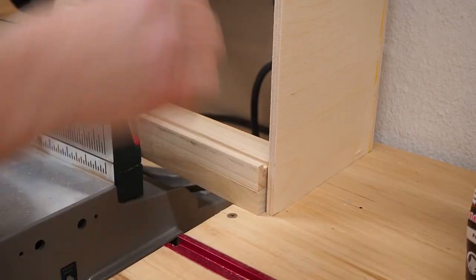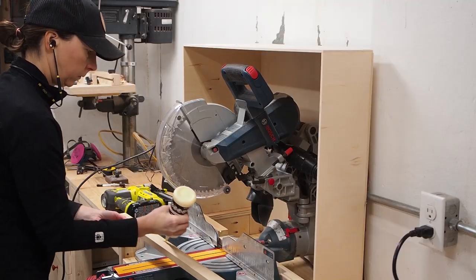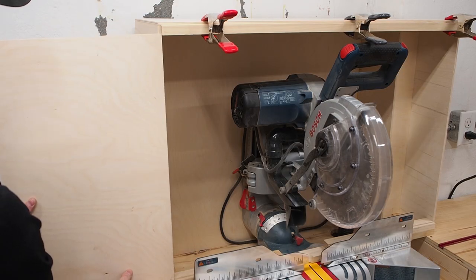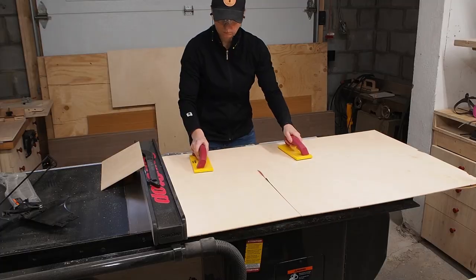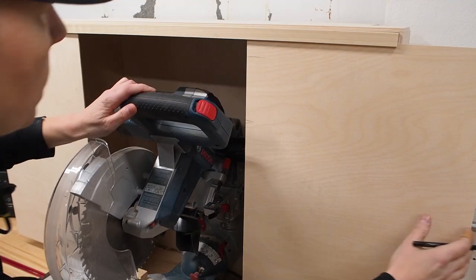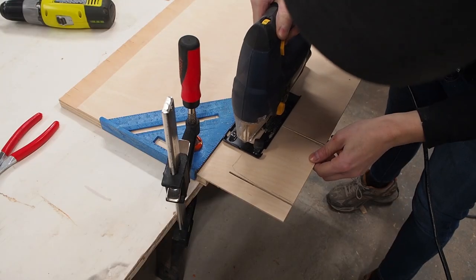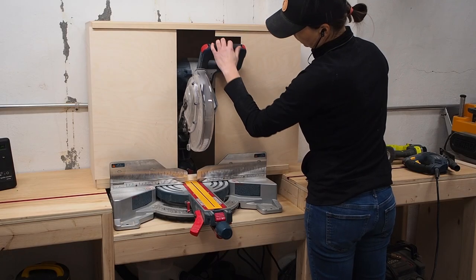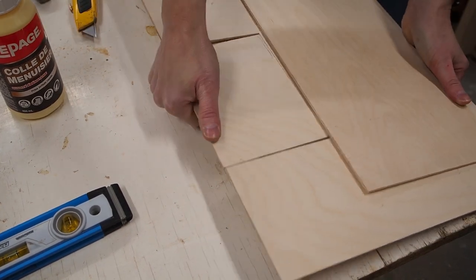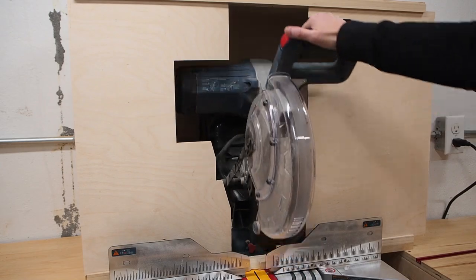I'll just add some glue and a few nails to hold the rail in place. I made another rail for the top and cut out the same groove, then attached it making sure the groove lined up with the front edge of the box so the doors could still slide in. Here I'm cutting the doors using one-eighth-inch plywood — I did a few tests and adjusted until they slid nice and smoothly. I want to close the doors as much as possible so I'm going to make a few cutouts for the handle and the motor. At first I used a jigsaw but it left a jagged edge on the thin plywood so I switched to a utility knife. After several passes I could just snap off the edge, and that worked much better. After making a few different cuts and tests until the saw moved freely in the 90-degree position, it was time for another air quality test.